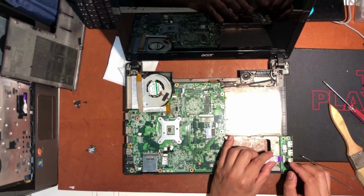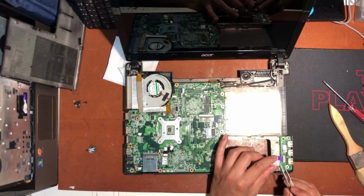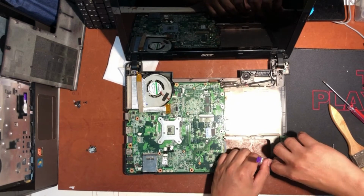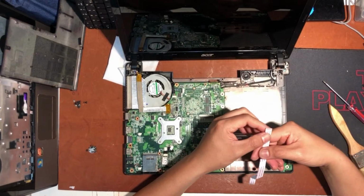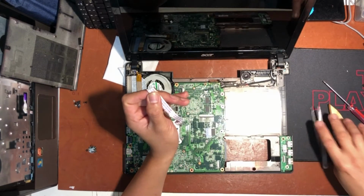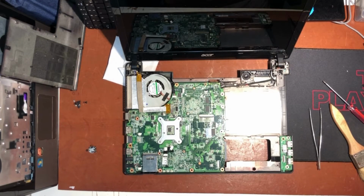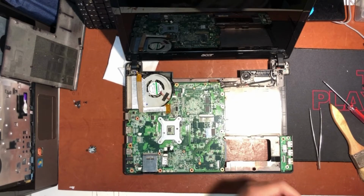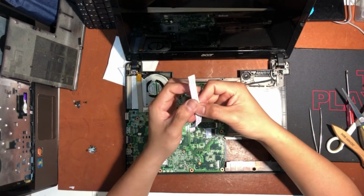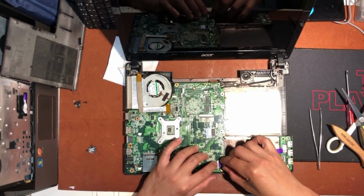So here I noticed that the end of this cable, the contacts are misaligned. What I did on this flat cable, I cut small pieces at the end of this flat cable, just only to remove the misaligned contacts. Since the cable became a little bit shorter, I need to refold it. Connecting the two ends of this flat cable is now fine.